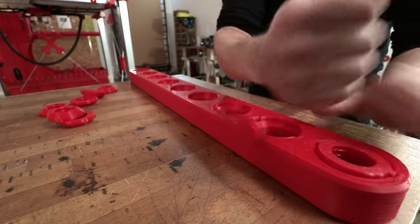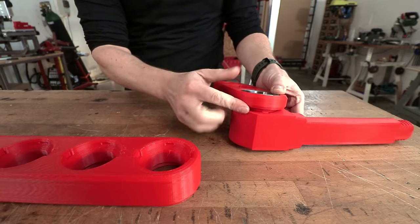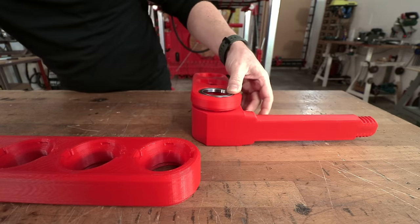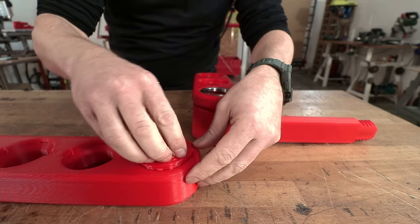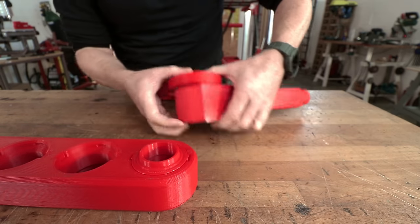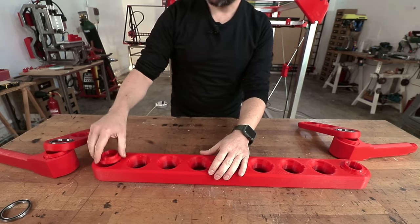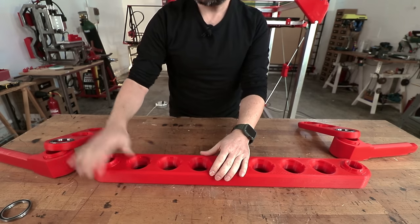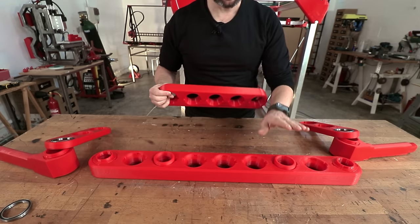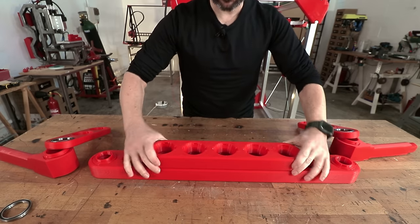Some nuts. This wheel shaft will rotate in this hole, and for that we are going to use this other spacer in here where you can exactly fit one of these bearings, like the one in the bottom. Like so. Same on the other side. And I'm using these spacers in here to interlock when you join two parts together.